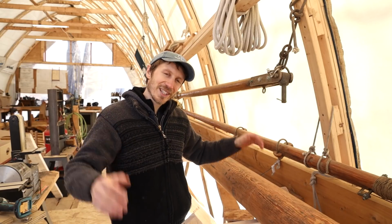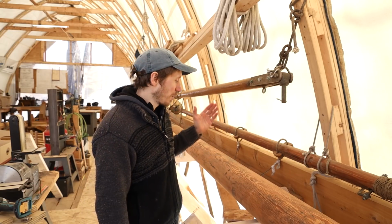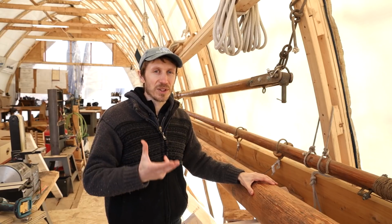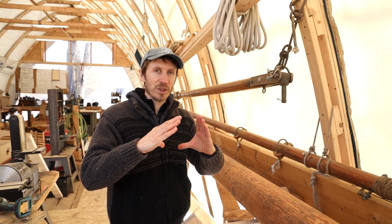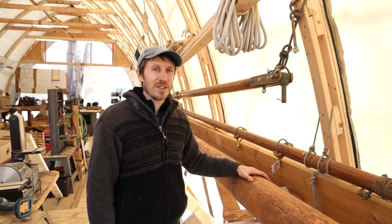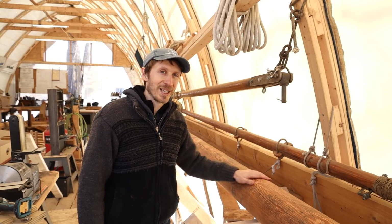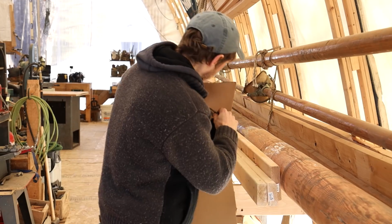And now everybody's going to say, why don't you make steady rests for it? Well, the problem with that is if we put steady rests down it, those steady rests are just going to move the stick with those irregularities, because it's not round, it's got some wobble in it. So we're just going to transfer that right down through yet again. So I think Steve and I came up with an idea for truing this thing up, and that's what those supplies are for. So that's what I'm going to be working on today.